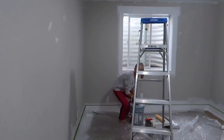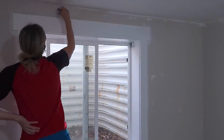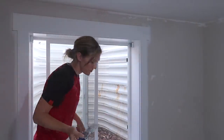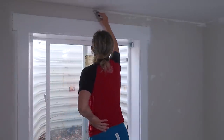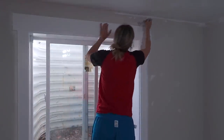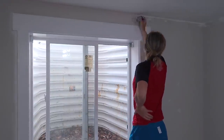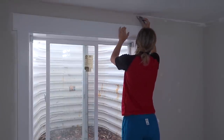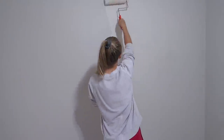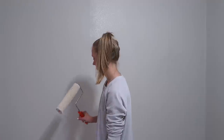After today, we should be almost done with the painting part of this room. The hardest part about painting trim, ceilings, and doors is that we needed about four coats on all the trim and doors, and you have to let it dry between each coat. I'm pretty good at cutting in the ceiling by hand, and Dave is not, so that's always been kind of my job. Even the cutting in around the windows, doors, and baseboards, plus Haley doing the full second coat on the walls, took two hours this day. Touching up the closet was another maybe 30 minutes — so two and a half hours of painting just on this day, and then we had to wait for it to dry once again.